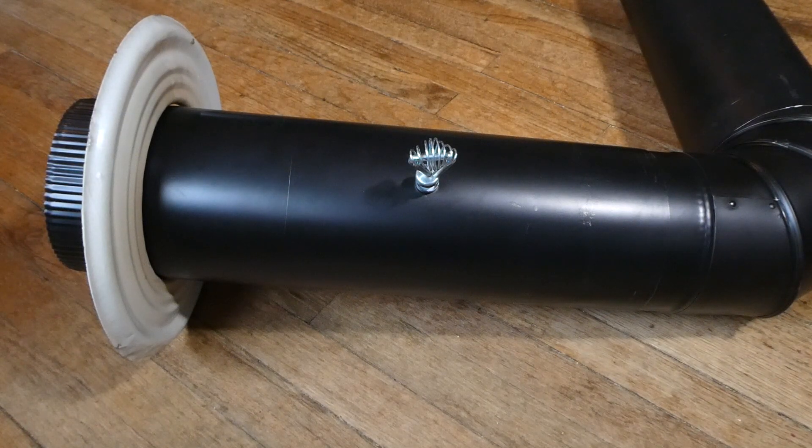I've got a piece of paper right here, and it's cut 20 inches long. What we're going to do is mark it halfway — 10 inches. That's going to be the reference for the seam of the pipe. We're gonna line that up on the seam of the pipe.